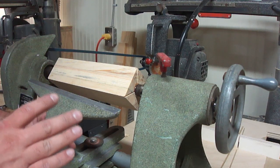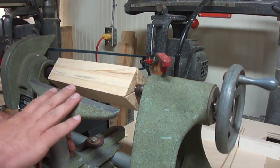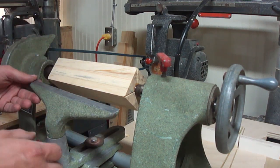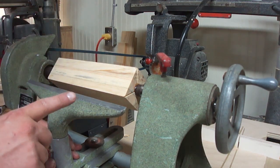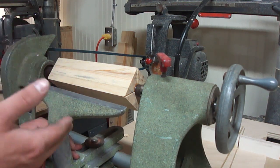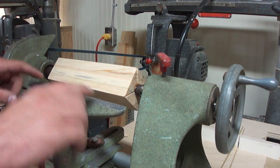Now this is one downside to this lathe, and that is the tool rest. There are a couple issues I see with it. None of them are deal breakers, but it's something to be aware of if you're choosing this versus another lathe. Issue number one, it's aluminum. That is a bad choice for a tool rest because it's very easy to nick this, and you don't want nicks in this thing